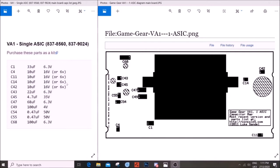Now, what I suggest when you actually take these things apart is start from the top of the parts list and work your way down. For me, I'm going to start with C1. This is the bottom middle left capacitor. All you're going to want to do is take your pliers and grasp it firmly either side, break free of the glue underneath, and then lift it up and down until the two little legs break. Pay attention, of course, to the positive and the negative terminal.